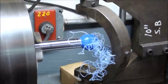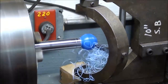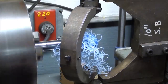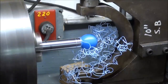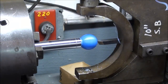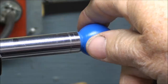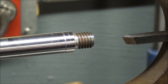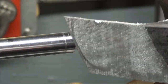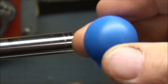I think the capacity of this attachment would be about a three inch ball. I don't think I can turn much smaller than a one inch or the tool extends too far. And there we have it — a one inch diameter Delrin ball. I would proceed to unscrew it off of the shaft or the mandrel. The shape of the tool I am using is like one of these universal tools only without any side rake on it, so it feeds or cuts pretty well going in both directions. And that is what the finished ball looks like.